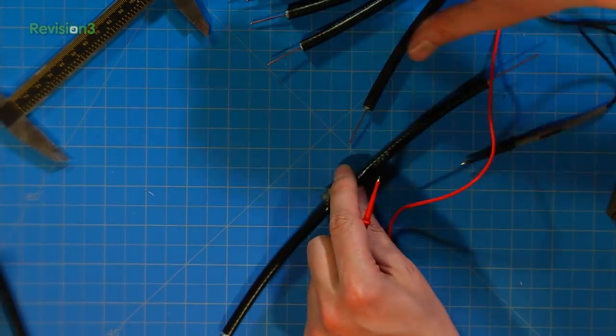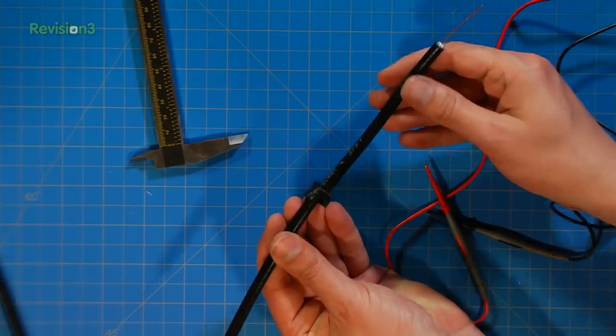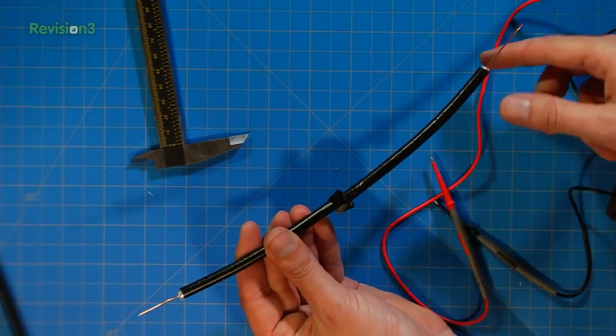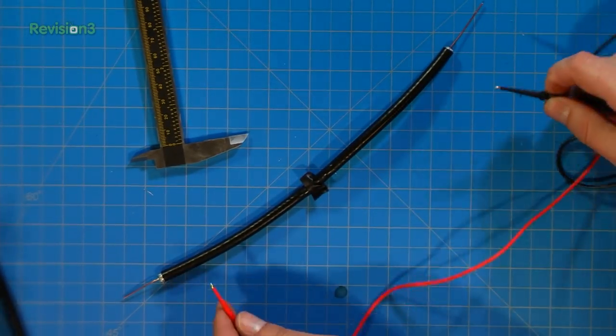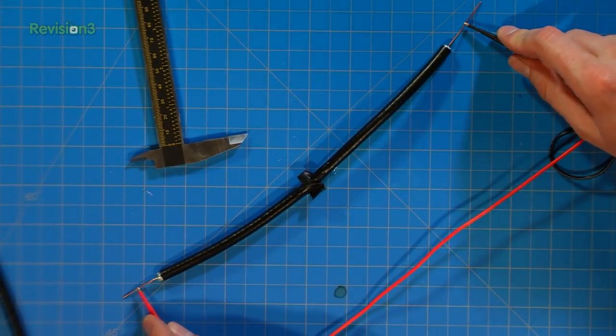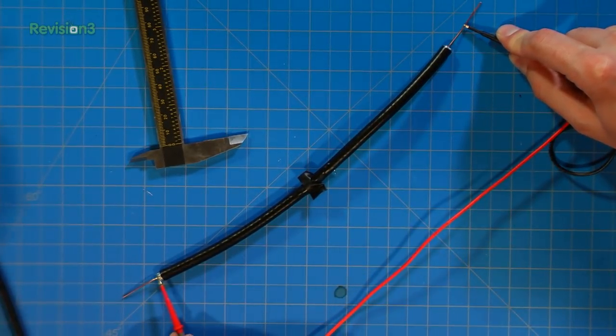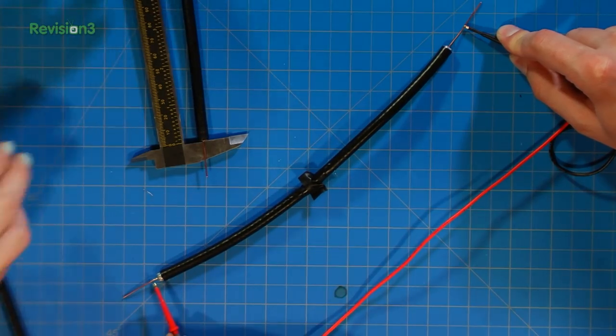And so what I'm going to do now that I have my first two pieces put together, you can see what we have is our copper here touching our aluminum and vice versa. So I'm going to go ahead and test continuity on both ends of these copper. And I shouldn't hear anything because they are not, in fact, touching. But holding the copper on this end and touching the aluminum, we can see that those are. And so it's very important that we do this test each time we put together another section, because we don't want our circuit closing in the middle of the thing, because then we'd have to go back and find out which one was the culprit.